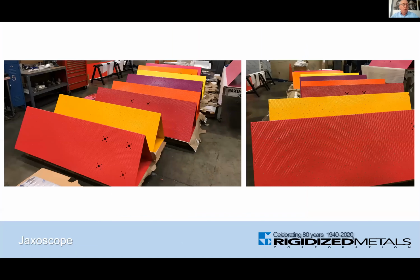These triangle tubes were produced with an outer tube and an inner tube. The outer tubes are 316 stainless steel. Both 12 gauge and 14 gauge were utilized with our 6HC pattern. Tiny holes for lighting were cut into each outer tube face and then powder coated.